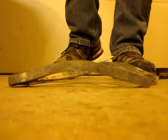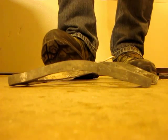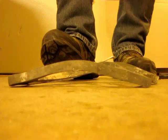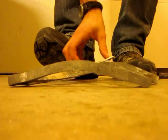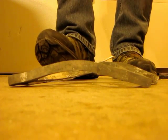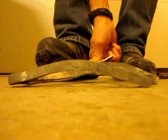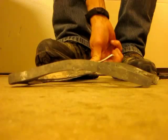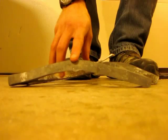This piece is pretty stout, and it's getting stouter the longer it sits here. I cold plunged it in ambient temperature water, and after it got back down to ambient temperature, I pulled it out and this piece of extruded stock was super soft — it was just like it was annealed. I could bend it super easy, and it's gotten a lot harder since then, and I think it will probably continue to get harder. This piece has not been age-hardened, which I need to learn more about. And this cast piece is stout — I'm bouncing all my weight on it and there's very little deflection.